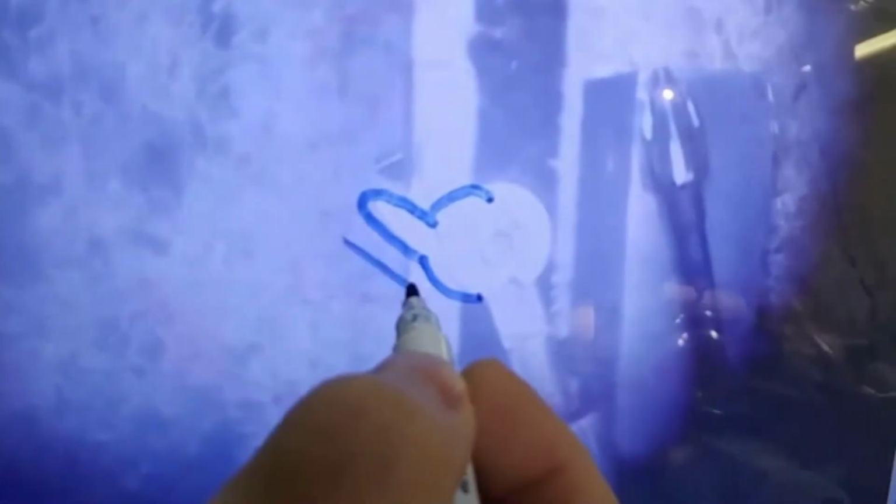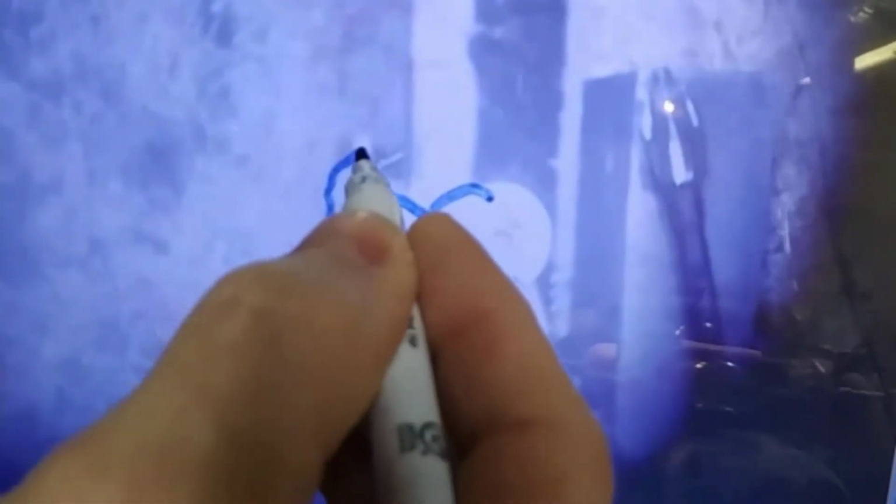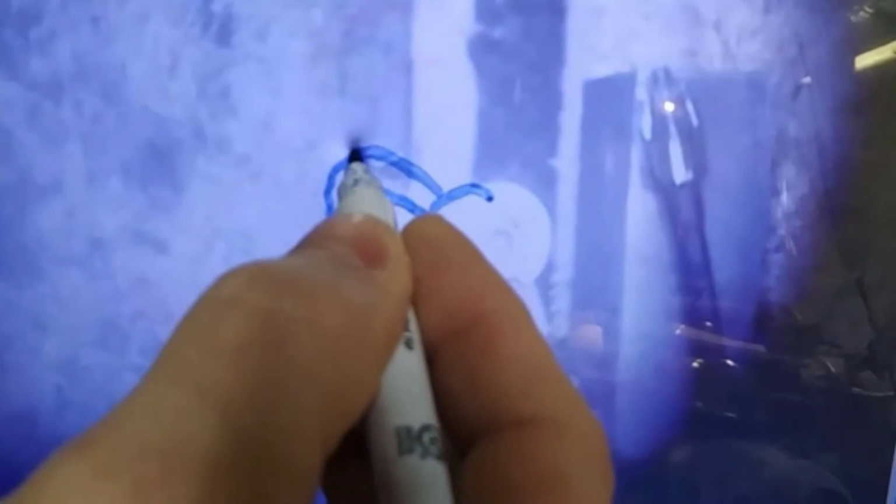Now, how do you make this more accurate? Well, this is where you could draw the wall thickness on your screen. I tend to draw it by freehand, but what I'm using is, I know the cutter I'm using is 3/16. So I use that to calibrate myself to draw a 3/16 diameter spread around there. Now, some guys want to be more accurate. They put a ruler underneath the camera and they draw exactly how thick they want this piece to be. And if you're good at that, more power to you.